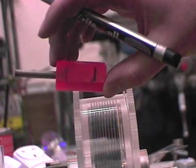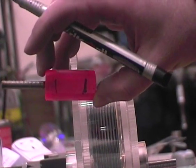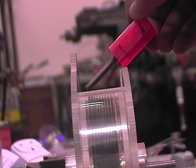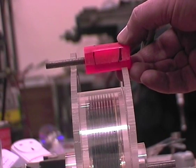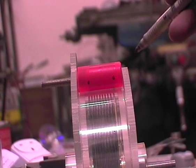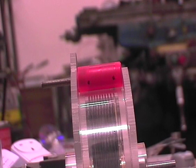I'm probably going to start with four 3mm holes, but that's part of the experimentation process. You could drill a series of small holes corresponding with the gaps in the discs, or you could cut a slot — this is all part of the experimentation. You're not stuck with just this one air injector; you could make any number and experiment with different hole patterns.